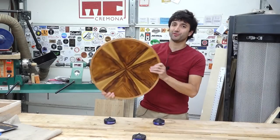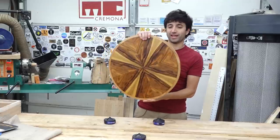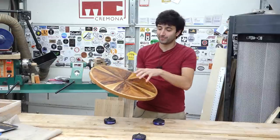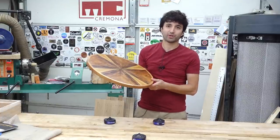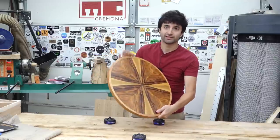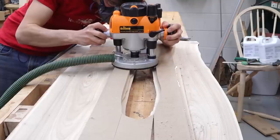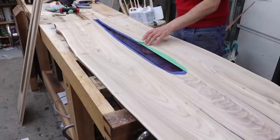So there is your radial veneer or sunburst pattern veneer with a solid wood segmented edge band. That is pretty darn cool. Now the process for actually inlaying, or I guess cutting the banding to match the shape of the field, in this case a circle, is the exact same process you'd use to inlay any shape into anything. So this is exactly the same process that I showed in my class on waterfall tables, where we did a glass inlay in one of the tabletops. It's all about using the mathematical magic of those offsets in your router bits as well as your guide bushings.